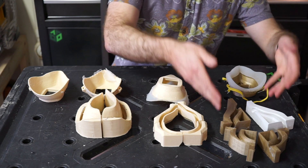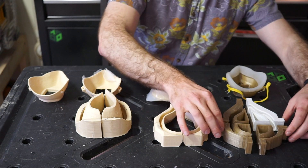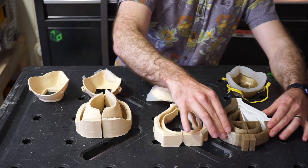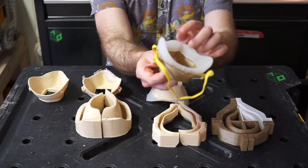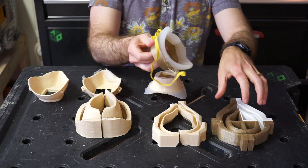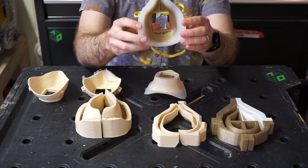That then led me to the final design here, which uses four parts like the previous version — since that came off easily, just was a big mess to clean up. I added clamp points to each side, which allowed me to get better sealing between each mold section. Then I added a cross-section in the middle so there are flat faces for everything to bite against, giving a nice flush seal. You can also tell it's rounded so it fits better to your face. To achieve that, I thickened the wall in my CAD software and then swept-cut a circle profile through the edge, giving it that nice roundness that contours to your face.